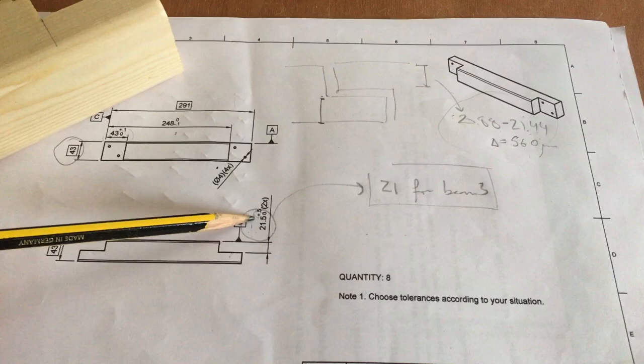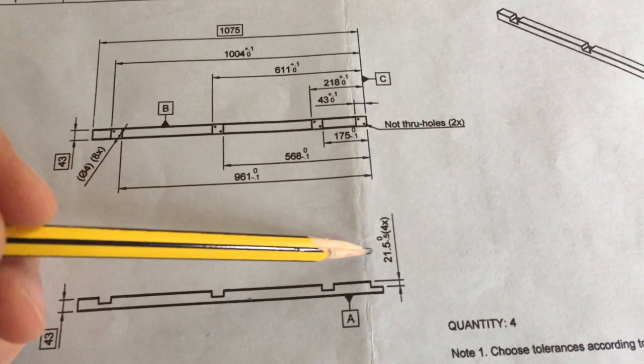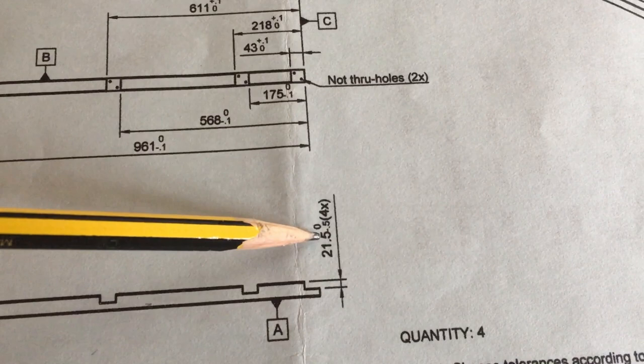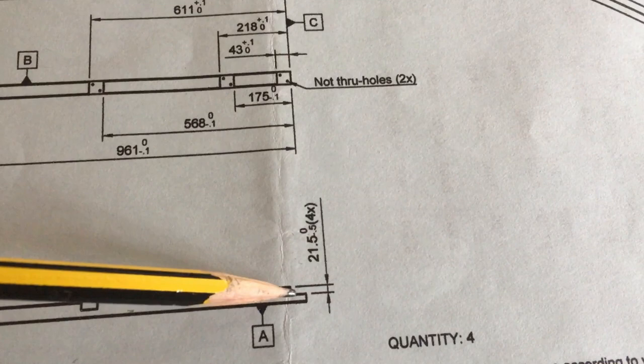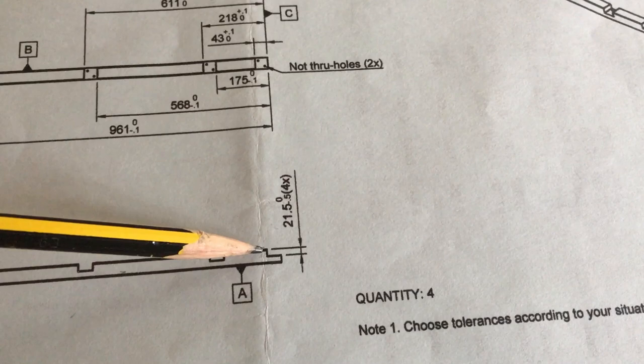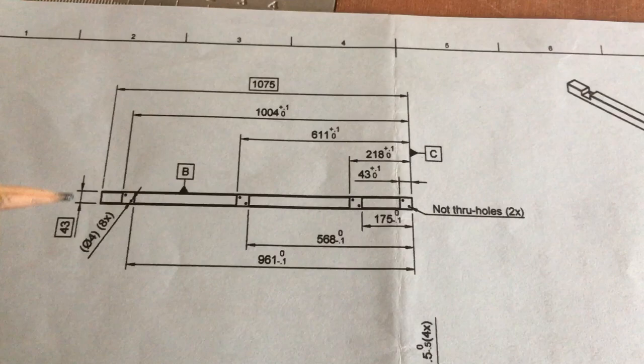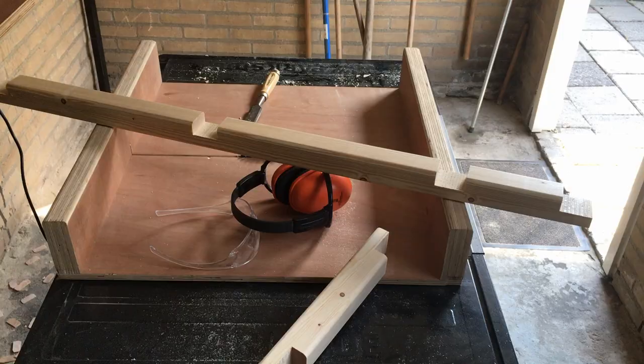I'm now creating pockets for the four corner beams — these need to be perfect for a tight fit to take advantage of the structural capabilities. I also check that the pocket size of 43 millimeters is sufficient. After the first pocket out of four, I get a very nicely fitting result — it doesn't fall, no gaps. Checking with a flat surface, there is virtually no gap — just need a little pressure. This is the result I was aiming for.